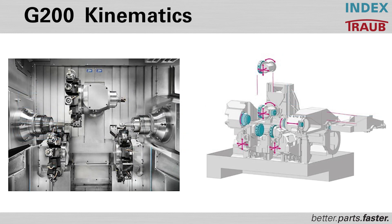Looking at the turrets, the upper turret can articulate as a B axis with up to five tool change capability. The two lower turrets both have Y axis and the ability to work on either spindle, allowing for truly balanced machining of your parts.